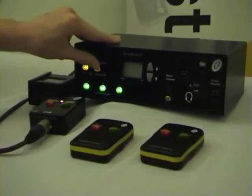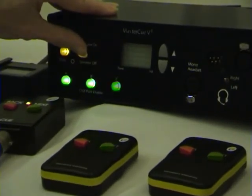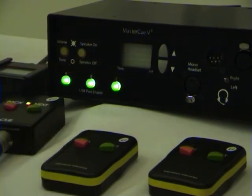This is carried out by depressing the speaker on/off button for 10 seconds. The display shows that the control unit is rebooting, and when the display clears, the control unit is now factory reset.